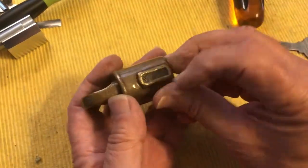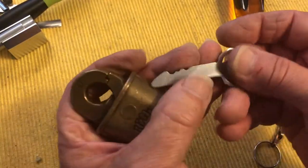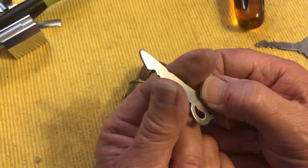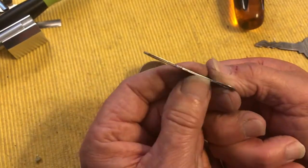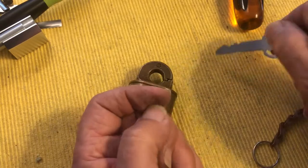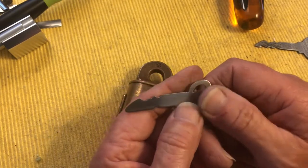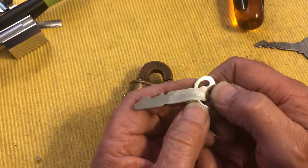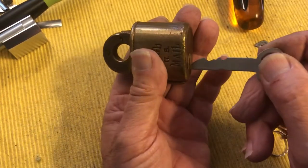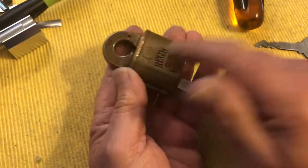I do have the newer version, which is flush — it doesn't have this raised part. Here's a key. It takes a while; this was all flat and a little bit too tall, so I ground it down on a bench grinder. It gets very hot, but you have a cool cup of water there to dip it in. You can grind on it for about three seconds and then dip it in the water, mostly because it gets hot and it'll burn your fingers. This goes in and it works quite nicely. I have a bunch more of these I've got to make keys for.